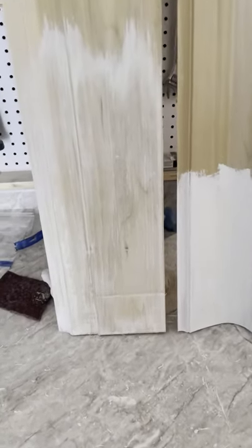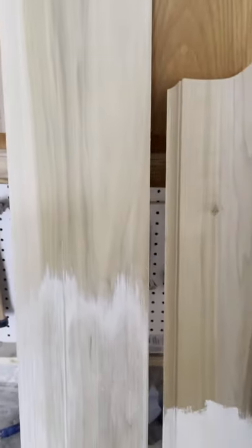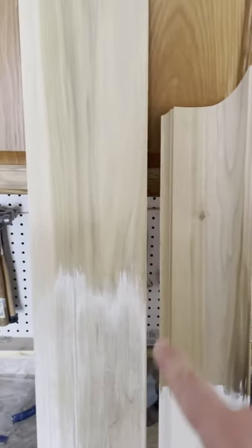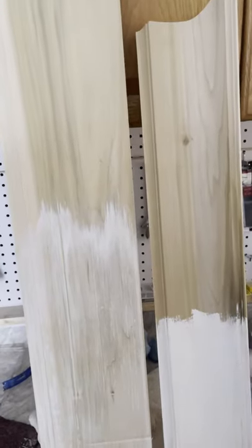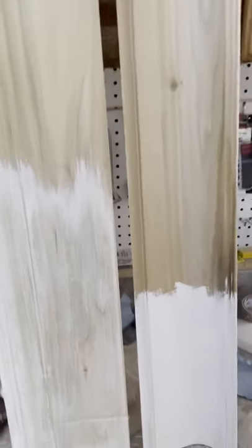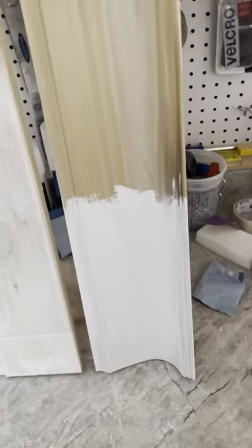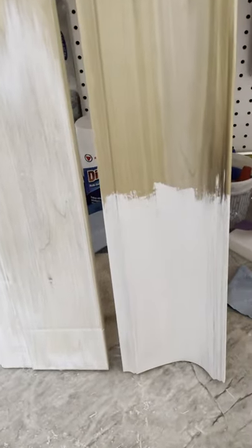We're doing some sample boards, as you can see. Poplar is an interesting wood overall — it's really not meant to be stained. Some people do, but it's got a lot of different color and variation, not a lot of grain to it, it's pretty flat. So when you paint it, it comes out really great. We put some solid stain on there — that's the white you can see — and then to get it off, I tried wiping it on, but there's not enough grain for it to grab.